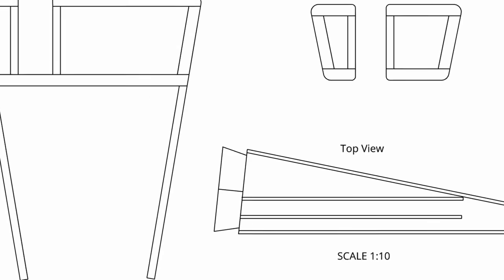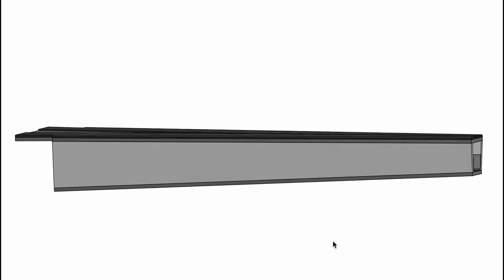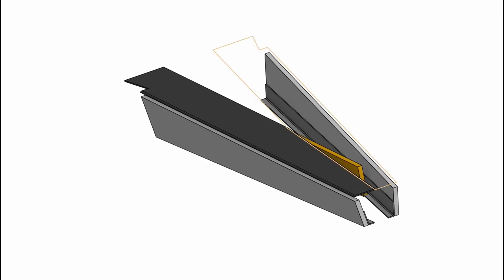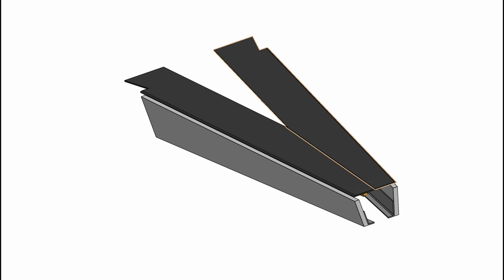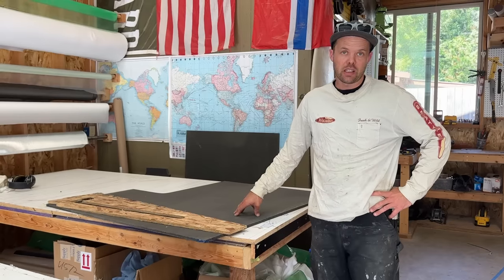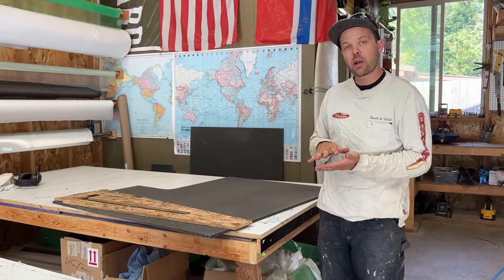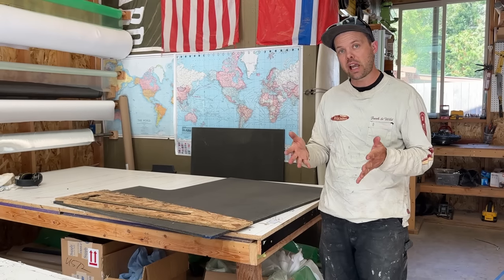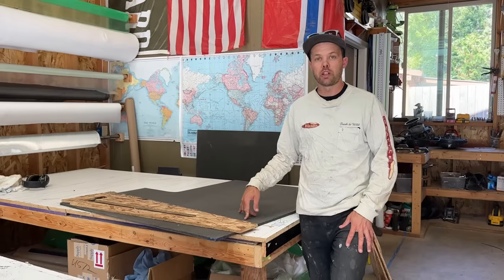The basic concept is it will be built as two box beams in the shape of a V. The starboard beam will carry the anchor roller, and there will be a channel cut into the sprit to allow room for the anchor's movements as well as to support it. It is designed to withstand three times the breaking strength of 7/16ths chain, which we plan to use. Today we're going to start building the bowsprit — the top, then the sides, the insides, and then the bottom, glue it all together, and then the gussets will go on before we glue it onto the boat.